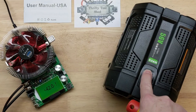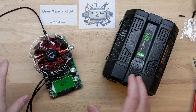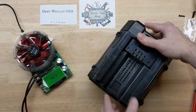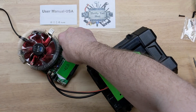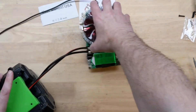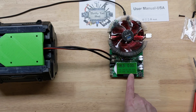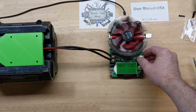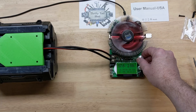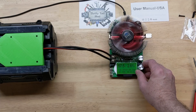Back now with this pack having been used in my mower — it tested and worked fine. I'm going to hook it up to my load tester like I did with the previous 5 amp hour pack. We'll plug it up and we're showing 58.3 volts here. Once current goes above half an amp, our test starts — everything is reset to zero, so we'll start pulling on the cells. I've got to be careful not to overdo the wattage, so I'll stay just shy of three amps. We're approaching 150 watts, so I can't go much more than that.